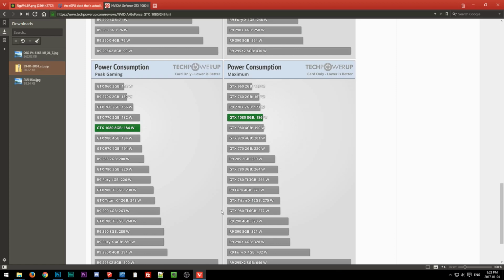The Pico PSU that can do the high wattage is the 12 volt version, which makes it a little harder to get AC/DC adapters that can do that. Because it's only rated for, I think, 160 or something like that, but it can do much higher than that if you give it a little bit of cooling. The HD Plex one that's coming out can do 200 watts straight up, and it can take a wide range, like 19 to 24 volt, I believe. So you can use 19 volt adapters, which are much more readily available in higher wattages. Like you can get the Dell, and I think HP makes one for the Voodoo, that are in the 250, 300, 330 watt ranges. So those are pretty good. Though, like I said, something really spiky like the Nano, maybe not.